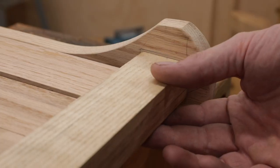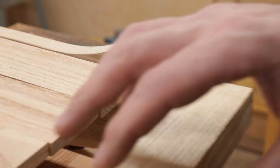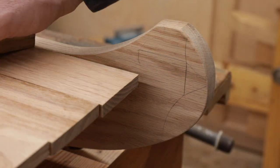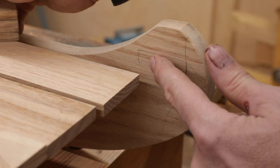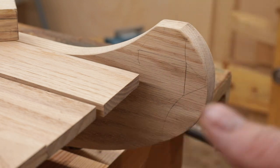While I had the clamp on, I just took and measured everything on that front to make sure it was all equal on both sides, then drew a line around there with a pencil. That is the exact size of our bullnose piece. Then we can chisel that out — we'll go three eighths of an inch deep with this one on both sides.